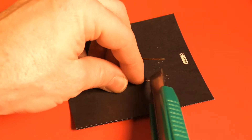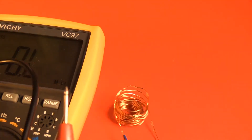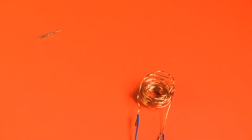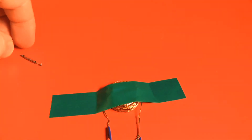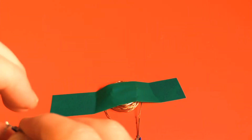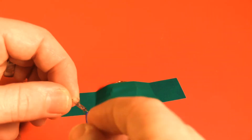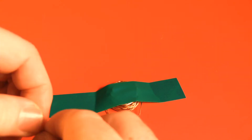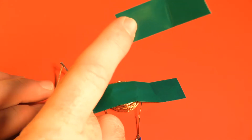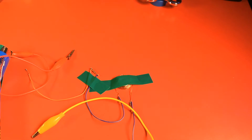You could also use an electromagnet instead of the voice coil. Strip the coating off the ends of the magnet wire, attach the connecting wires, and tape this to a desk. Check that the coil is conductive and has a small amount of resistance. Now connect one end of the voice coil to the reed switch and the other end to another connecting wire and attach this to the desk. This will switch the voice coil on and off using the magnets on the fidget spinner. Have the reed switch and voice coil apart roughly equal to the distance between the arms on the fidget spinner, although you'll need to adjust this distance to make it work.